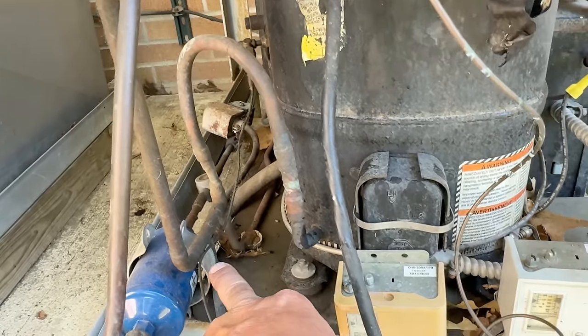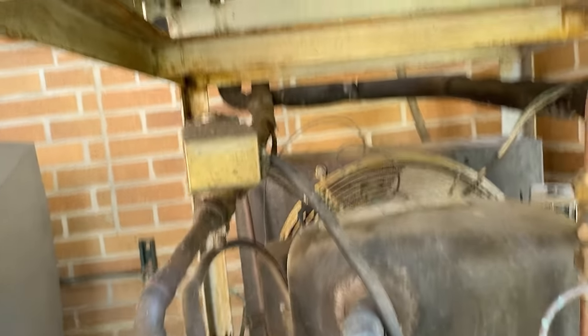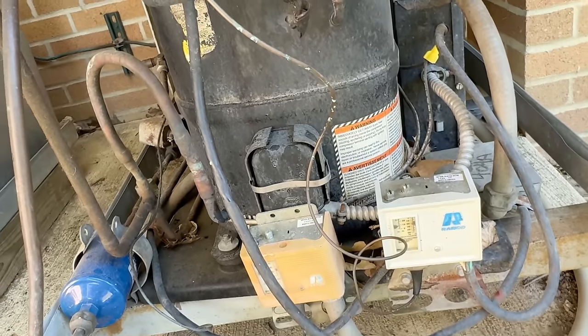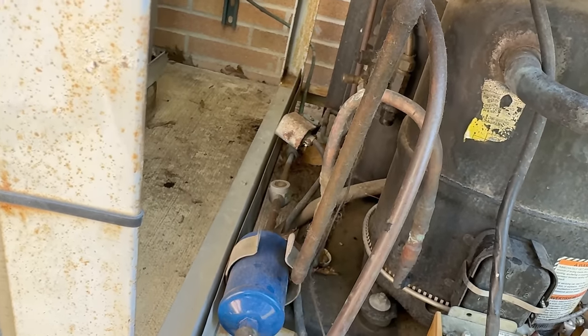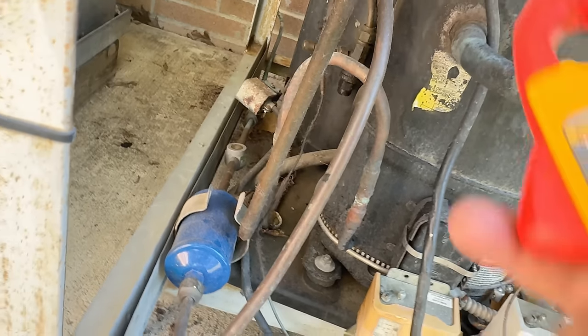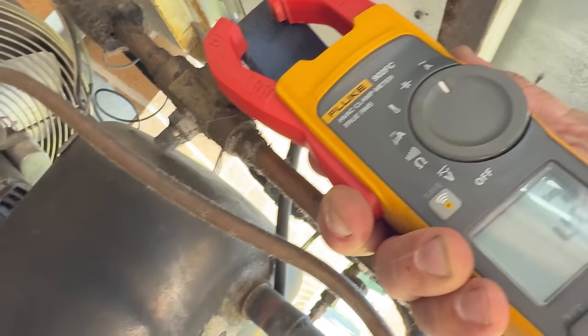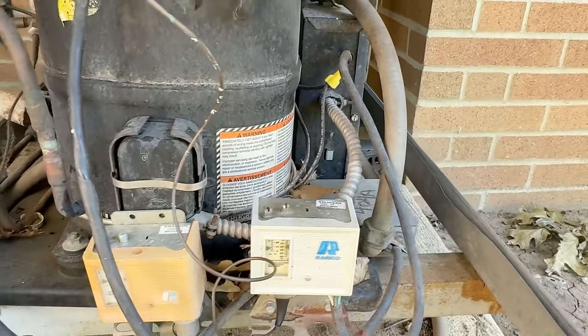So it comes right off the hot gas there — comes out of the compressor, goes to the condenser, and also allows it to go out to the evaporator. So they must be doing a homemade hot gas defrost system. That coil down there should still be the liquid line for the evaporator because you've got a sight glass right there. The hot gas line is the one that's actually energized, and it's oily — which is great. So it theoretically thinks it's in a defrost.